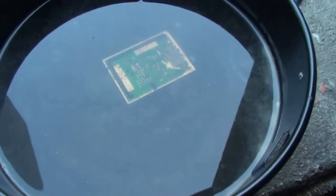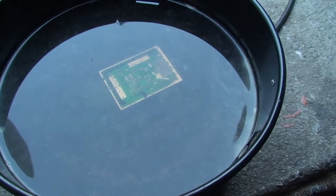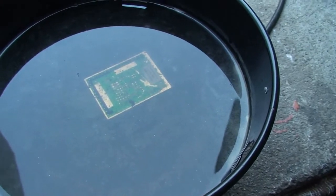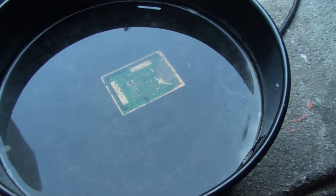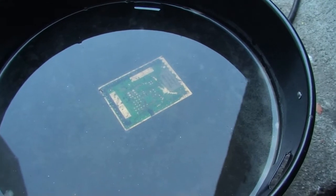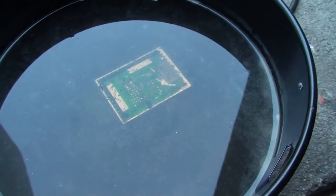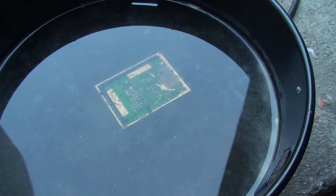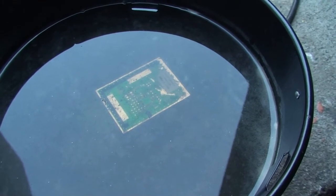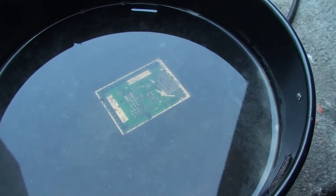Of course I have the same problem as before — it's not heating up properly. It should be almost boiling or boiling. However, we will get away with it, I think, because the solder mask on there is very, very thin, so it should work out. And this is obviously not just water — I use sodium hydroxide for it, but you can use a strong household lye.